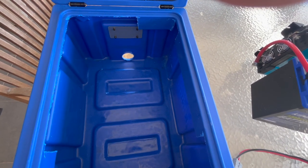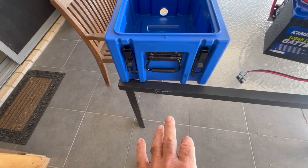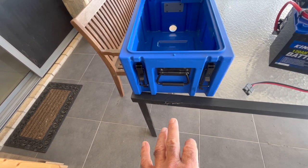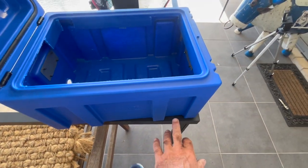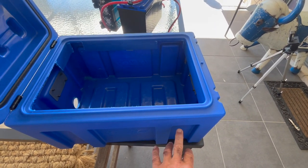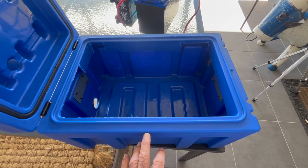I'm going to cut in more air vents, and I'm going to put a hole in the front to run an electrical cable through for the 240 volt AC so I can run a cord out of that. I've also got to cut another hole to get an Anderson plug out, which I use to run my trolling motor. This battery gets used to run my trolling motor and it will also be used to run the inverter — not at the same time, but it gives it a dual purpose.